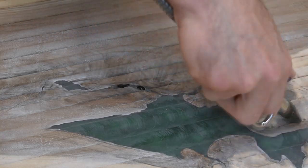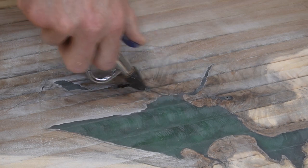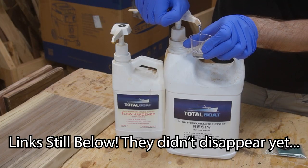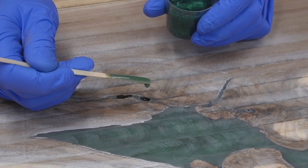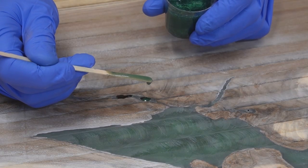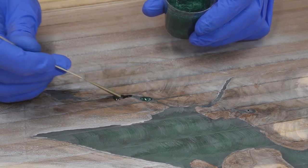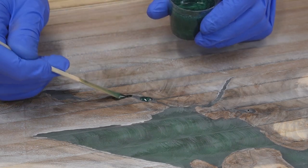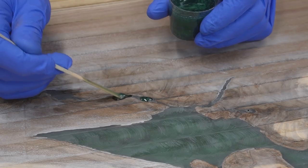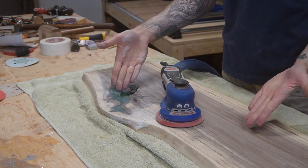You can see those little air bubbles. So with them all blown out and ready to go, I mixed up some TotalBoat high-performance epoxy this time and filled up those holes. The nice thing about the high-performance is it cures in like five hours, so I usually leave it overnight and in the morning it's nice and hard and ready to go.